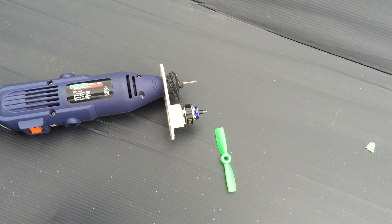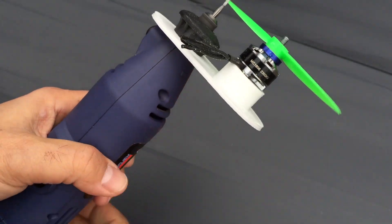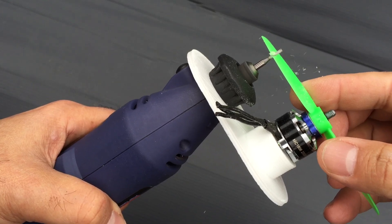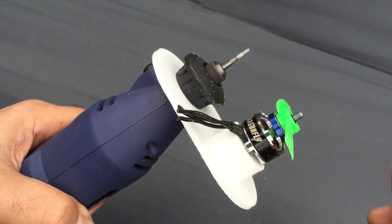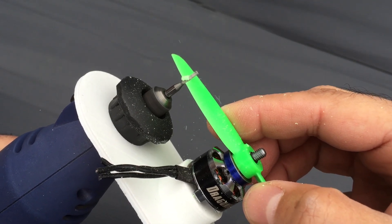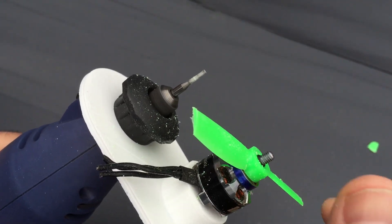Realistically you could use anything to make this part — plywood, metal, it's pretty basic. We don't want the spindle speed to be too high, so make sure it's not too fast because you don't want to be heating up the plastic, you want to be cutting it. It's still going to be running reasonably fast. You can see the swarf building up on the part of the prop that's going to be cut off — that's what we want. I'm going through nice and slowly with even pressure, not speeding up, and towards the end I slow down just a touch.